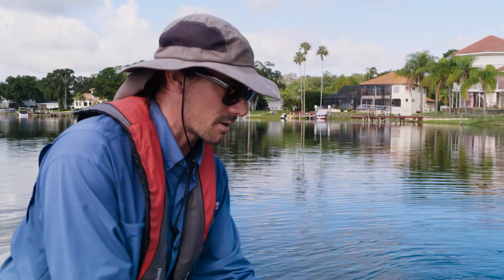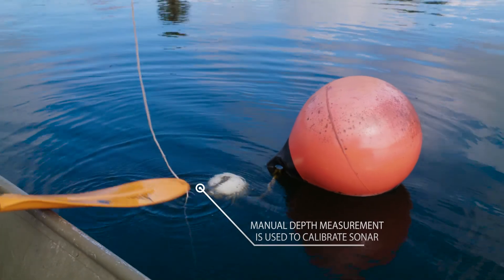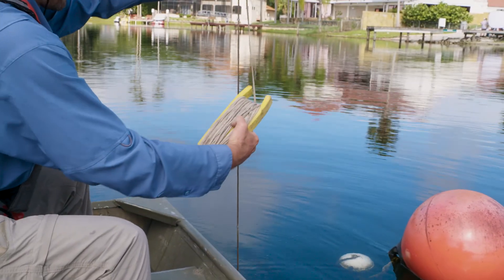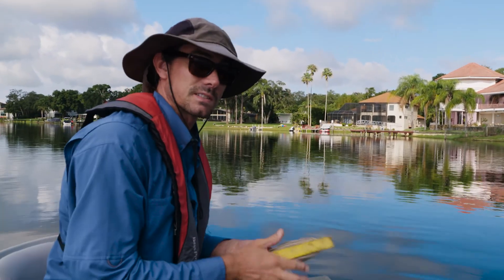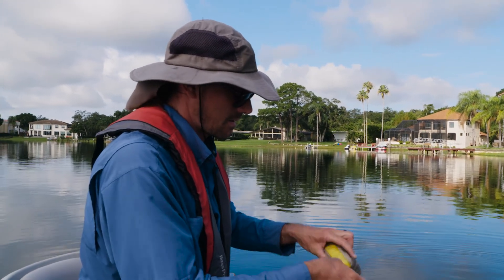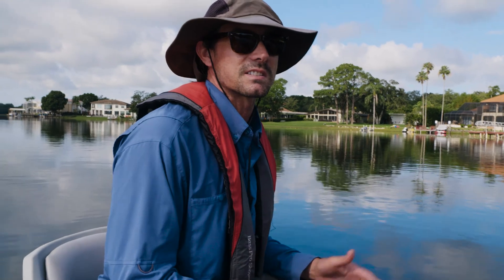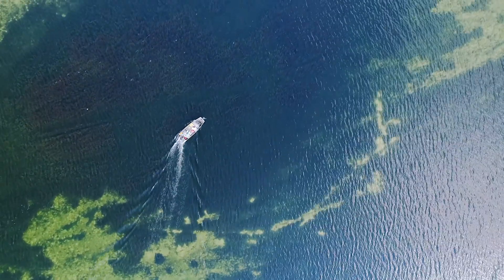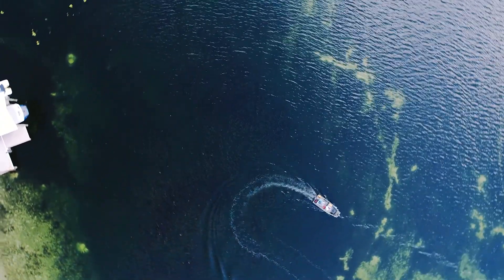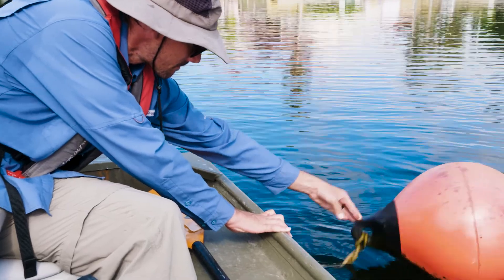What we want to do is use this as kind of a target. I'm going to go ahead and measure the depth here just to this side of the buoy. It's about 11.6 feet deep here next to the buoy. Now we're going to look at the sonar unit and make sure that it's reading somewhere in the vicinity of 11.6 feet while we're moving. When we're sitting still, the transducers aren't quite going to be at the same depth as when we're moving. When we got right up to the buoy, it was about 11.4 to 11.5 feet deep — that's within the range of tolerance.